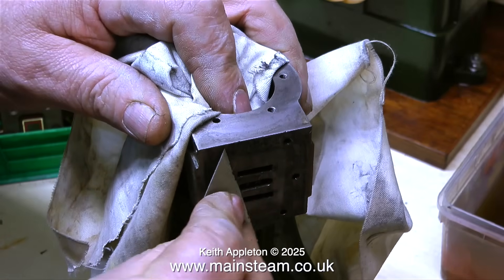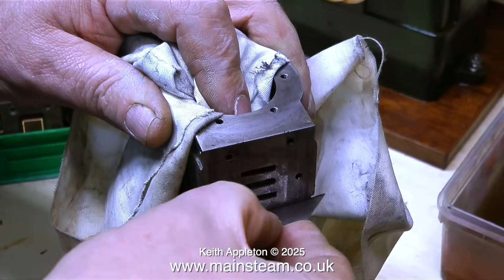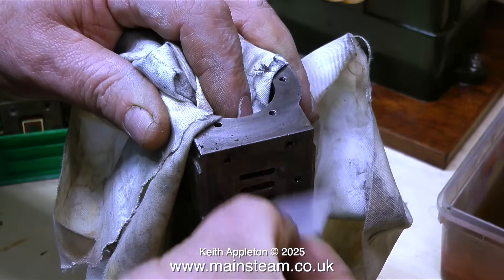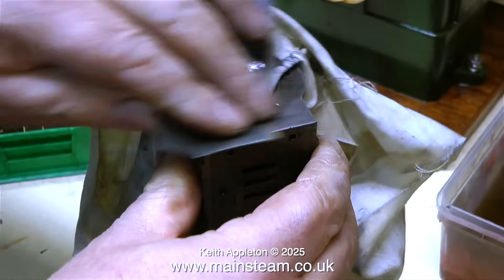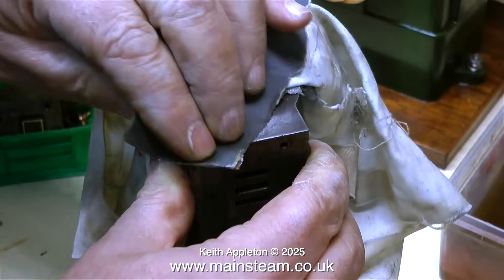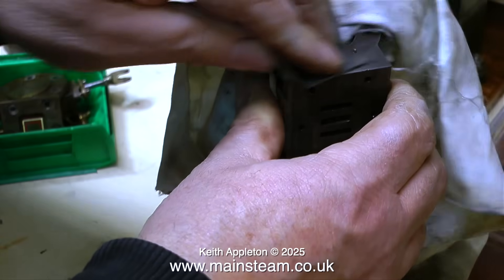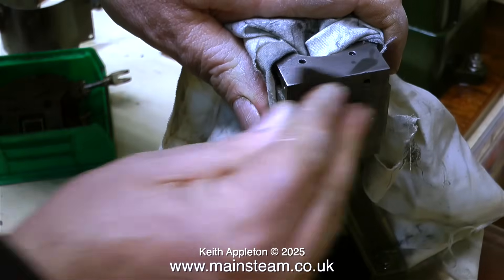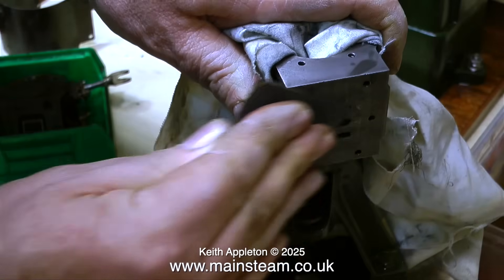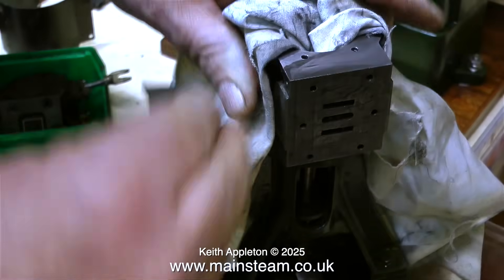I'm using a very sharp blade to scrape off any residue from the mating surfaces as well as the last of the varnish from the top of the steam chest part of the cylinder casting. In this clip I'm scraping the port face - there is evidence of some kind of a sealant. Now I'm using some 400 grit wet-and-dry sandpaper to just shine up the top of the cylinder block. You will notice that there is a cloth pushed into the cylinder bore - this is to stop any grit from entering the bore and causing damage. To be honest, the first steam that contacts the cylinder condenses to water, and the mixture of water and steam will clean the cylinder bore very effectively, blowing any particles out of the drain cocks.